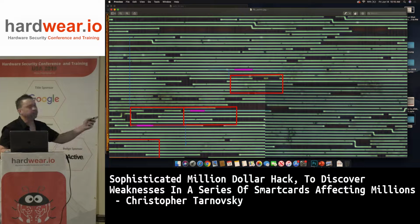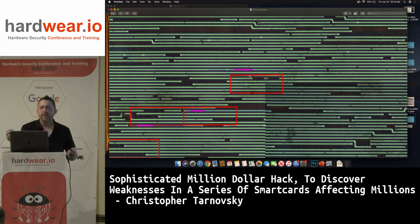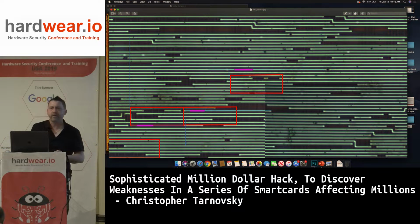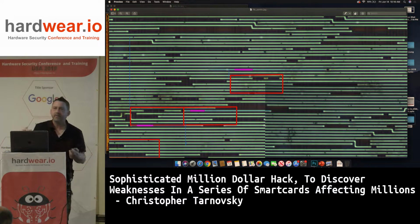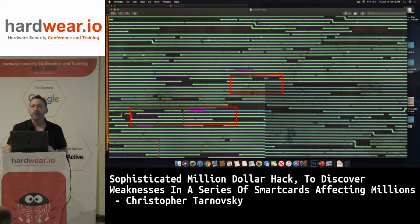So you'll see in my picture, 0 to 15, but then I have some C code that takes my captured output and reorders the bits. It's trivial, but it takes about an hour or 2 to figure out the ordering. And then there were a couple of bit errors. You throw it through your disassembler and you realize, okay, the running code that I just captured doesn't look right, but it's pretty close. You flip a couple, swap a couple of bit positions, you're good. They're not doing any kind of inverting or anything. Everything's direct. So once you're through the crypto, you have direct values.